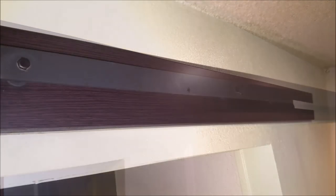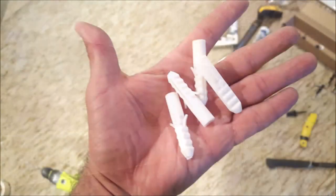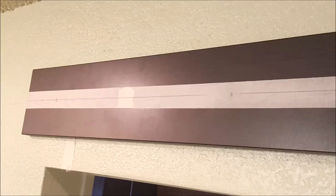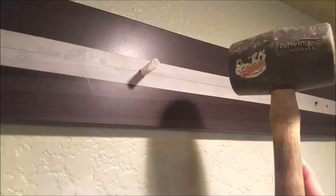The next step is installing the track, which is what the wheels actually roll on. To install this, we're going to have to mark the holes — all these holes are pre-drilled, so these are the holes we have to go by. To mark those holes, I use masking tape because the wood is so dark you can't see it, so I put masking tape on that center line. Then I hold that track up in place and mark every hole where it needs to be. Then I go ahead and drill those holes to whatever drill size it recommends.